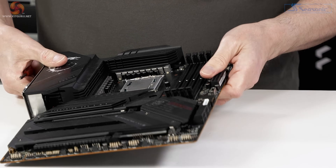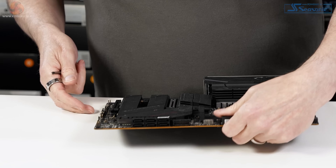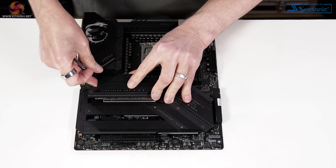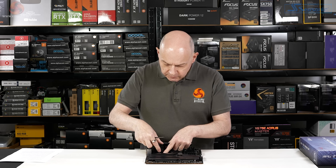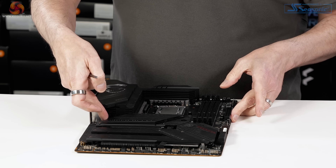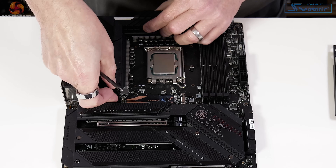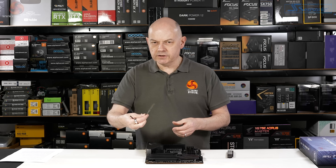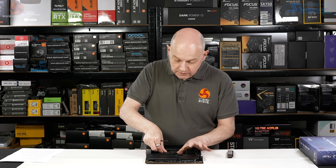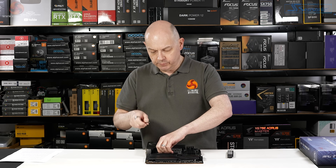Main power connector at the side next to a Type-C connector, a laid-down old-school USB Type-A connector, and laid-down SATA. For M.2 installation, the primary slot above the graphics slot — that catch releases. It came away in one go, which is interesting. Let's put that back and try again. Release that catch and lift it off, and this time the SSD remains in place. Release the plastic catch and the SSD comes out. So installation and removal is tool-free — removal of the SSD is almost hands-free, which means you haven't got to fiddle around with a very small screw while the board's upright in your PC.